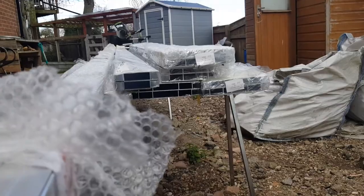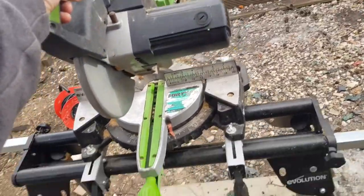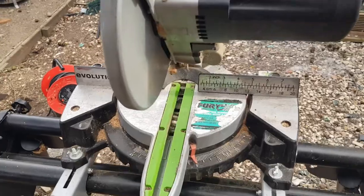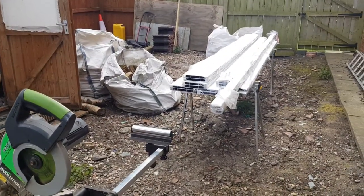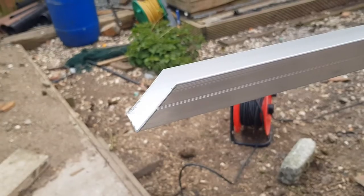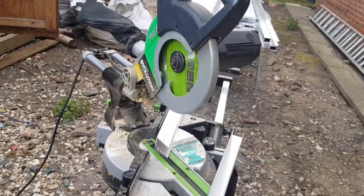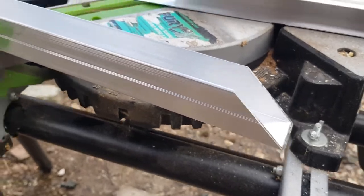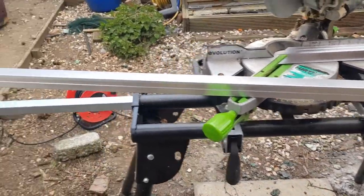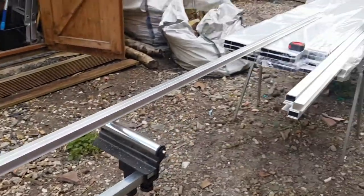Then we're going to fill it with these aluminium planks, as you'll see. We've got this cross-cut saw — one of those multi-blades that cuts steel, aluminium, and wood. The first cut was a little bit rough so I had to clean it up with a file, but I put a new blade on the chop saw and it made a massive difference. The next cut was almost perfect — nice and clean. So we're going to start with the channel and do these ends at 45 degrees, and you'll see when I put them on the truck why we're doing them at 45.